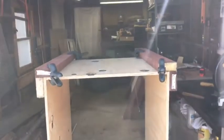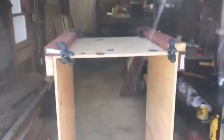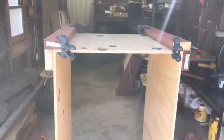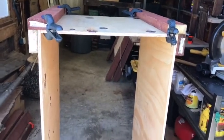Okay, so you guys just saw me put the sides together. I built the sides with the little corner leg things. Now we're going to do the end caps of the end piece. So basically all I did was I stood the 2 sides up on end, this guy and this guy. I took the 2 end pieces, the 23 by 24 inch pieces of plywood. I just set him in here and used the clamps to help hold them together so that it doesn't fall on my head when I'm working or tip over. They're just kind of there. It's not super strong or secure, it's just to hold it in place.